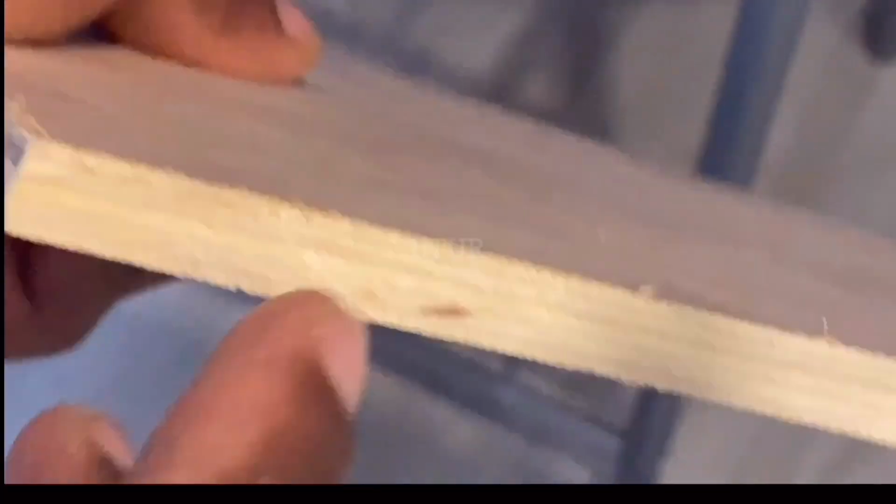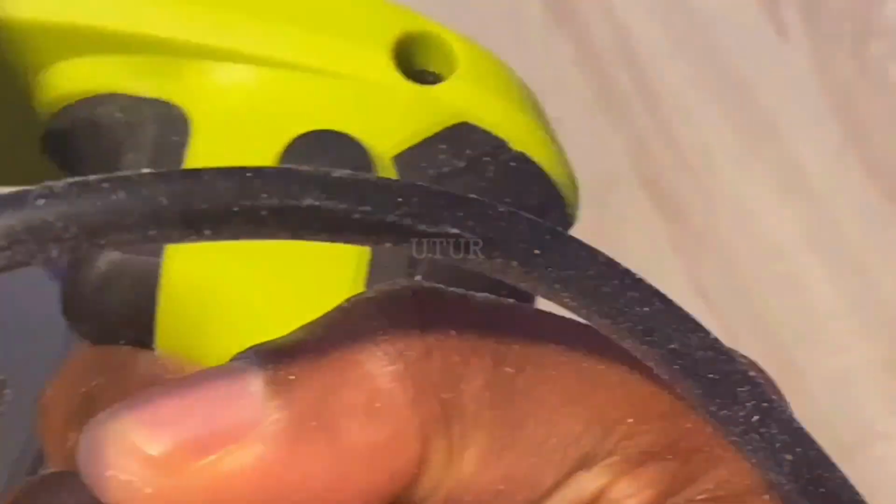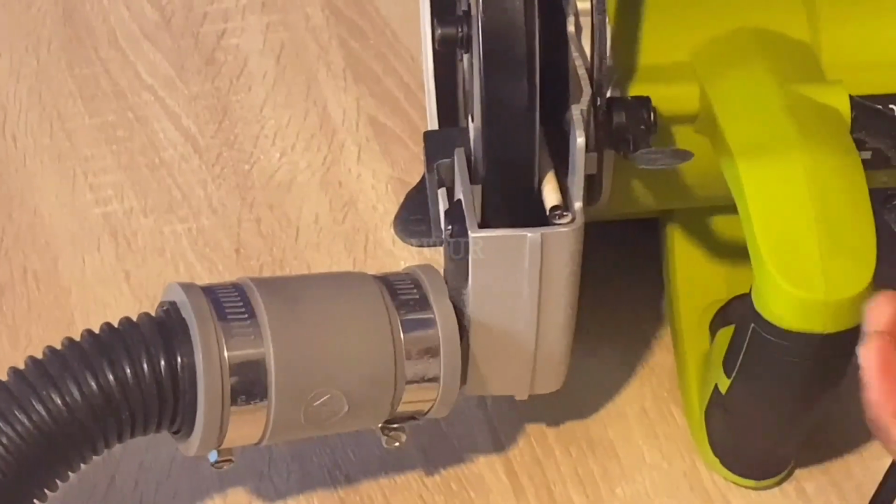At best, the blade has just done a slightly below par, medium cross cutting and ripping of the hardwood plywood. A combination or general purpose blade would have done a much better job with respect to getting quality cuts. Once done, place the working tool on its underside. Despite the fact that we've got a lower blade guard to protect the blade, you don't always want to be placing a working tool where you've got the blade, because that could damage the blade accidentally.